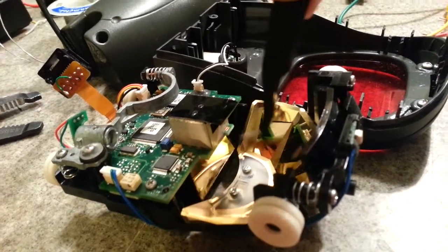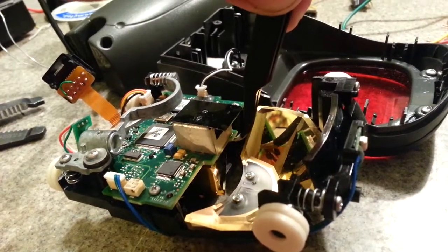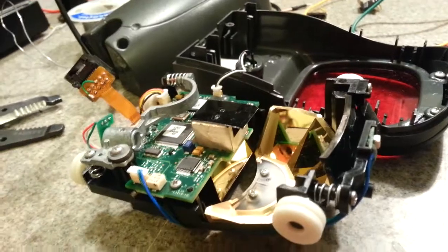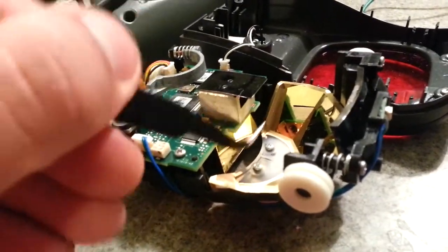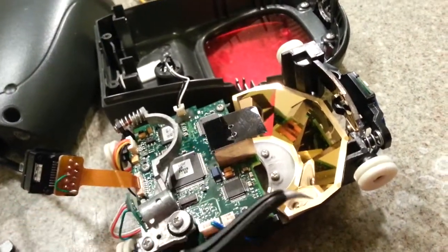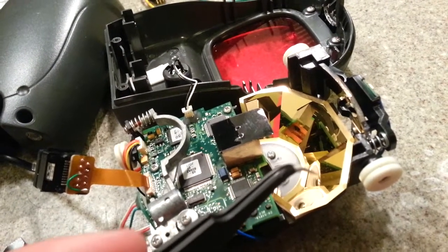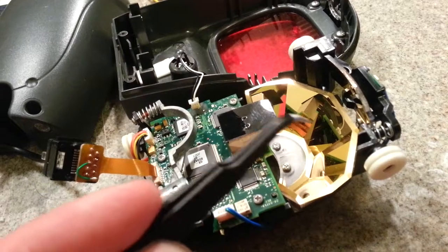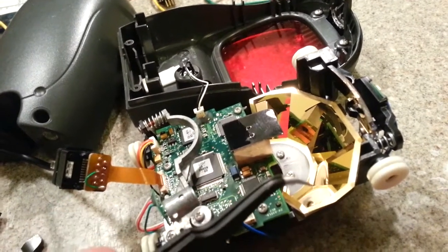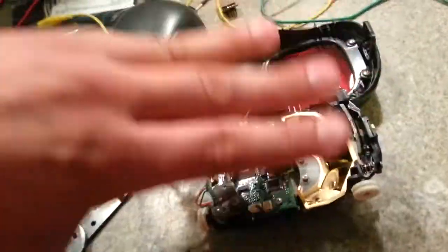If we look at this, you can see that this is actually on a rotating carriage, and this has three different mirrors on it that are each angled at a different angle, so that when it reflects off of this mirror onto this half of an octagon of mirrors here, it ends up being three lines on each of these mirrors. Since each of these are then angled differently, that ends up being multiple sets of three lines, which I thought was kind of clever.